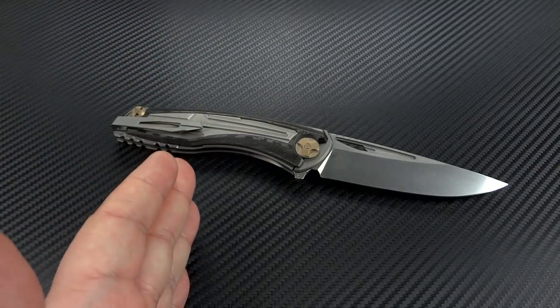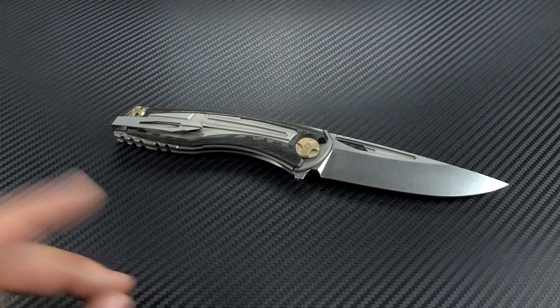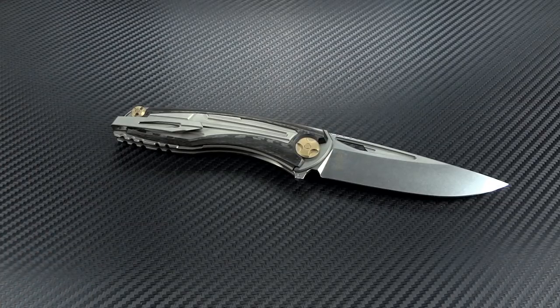So it is three people. Everything is done in-house, including the design work. So again, that's where I lean more toward custom. The production of each part is accompanied by a large number of technological transitions, which include the use of both universal metalworking equipment, so manual work, and CNC machines, but all details are ultimately finalized by hand, and the grinding of the blade and assembly are completely manual operations.